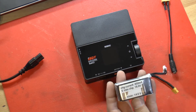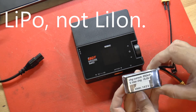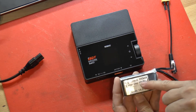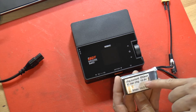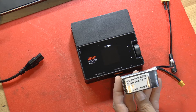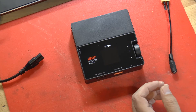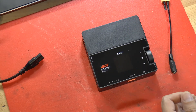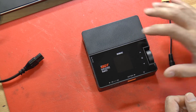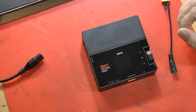The other kind of pack that we need to charge is a lithium-ion pack, and for this pack the charge current is going to be 850 milliamps and its maximum charge is going to be 16.8 volts. I'm going to show you how to charge both of those two battery packs using the single charger that we have. Some people on the team have the single charger and some have the double charger, so I'm going to show you how to use the single charger in this video.